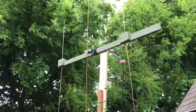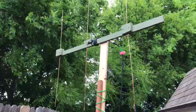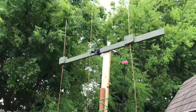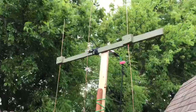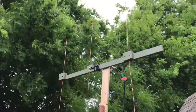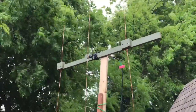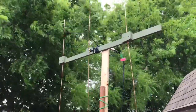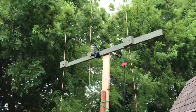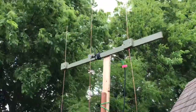That's the two-meter antenna. I may do a quick video on the others and just talk about Yagis in general, because it seems like there's a lot of misunderstanding — you're not going to get high gain and broadband, it's just not going to happen. If you've got some different ideas, I'd be interested in seeing your comments, but this is about what I thought would be good for a portable, truly portable operation.